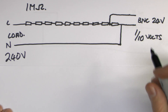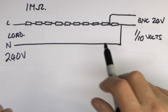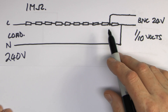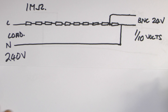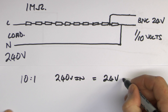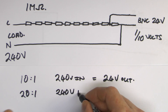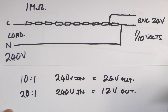This is a 10 to 1 divider - 240V in gives 24V out. You can of course make these in other arrangements. A 20 to 1 divider can be made with 20 resistors in the line tapping from the end, or with a line of 1 megohm resistors and then two 500 kilohm resistors at the end, tapping off the very last one - giving you 240V in and 12V out. The same principles apply if you want to measure something at much higher voltages.